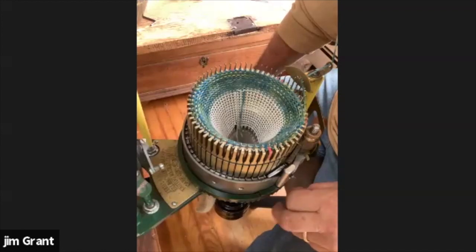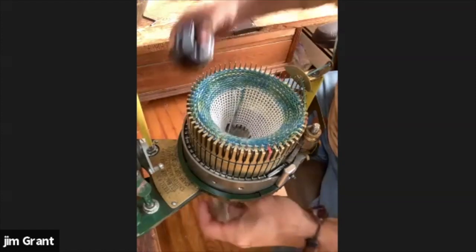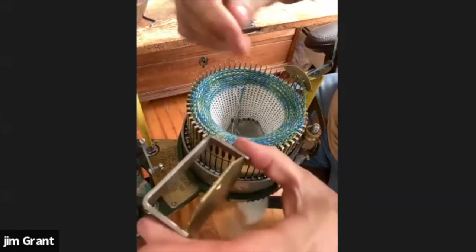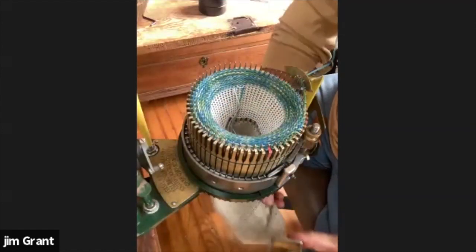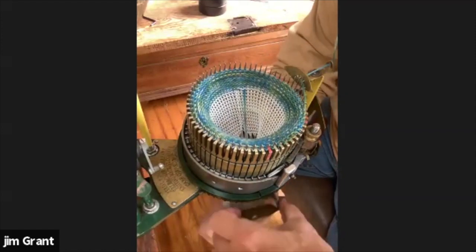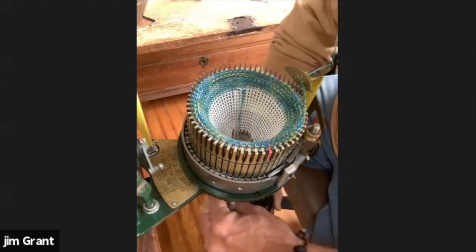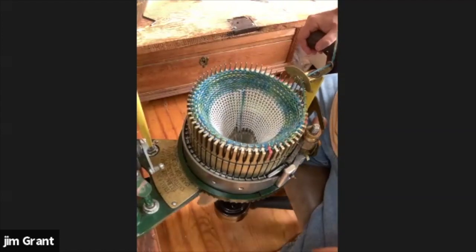Oh, hey Jim, this is a silly question, but can you show how you put the belt buckle on to put the weights on? Yeah. So when you first put your buckle on, you want to have it with the hole pointing up, and then you're going to put your cast on bonnet in it with the hole pointing up. Pull it up a ways and then twist it so it's pointing downward. And that has your hole pointing downward. Then you can put your stem weights right in it. And you want to make sure you keep your feet out from underneath it.